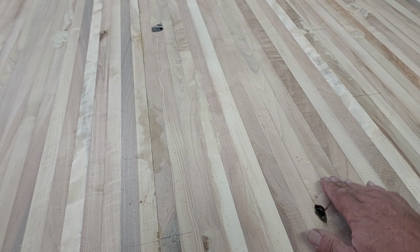So guys, to assemble the benches so that it looks like that one, I use the Domino again. I use an 8x50 domino, which is quite a sturdy one, and we're going to domino it on the miters. Because my stock is nice and thick, in this case 40mm, I can go quite deep on this. If you look at that, it's quite a serious tenon. I'm going to put 4 on each side, and this will be very strong. Me, my wife and my daughter have been on this one early on to check the strength, and this is as solid as can be. So let me get this last bench assembled and we can continue sanding.